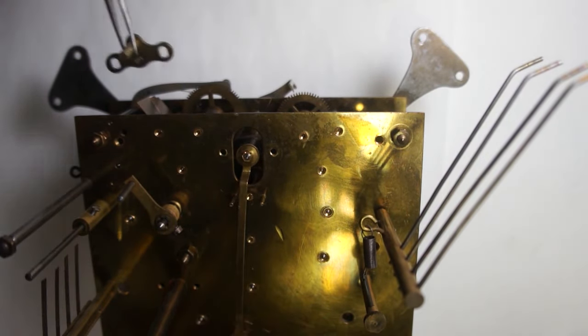So what I'm finding on this door is somebody in the past has glued this piece of cardboard on here. I believe they glued it on as a strengthener, and they've gone in the corners here and they've put some sewing needles in here for nails, and they've also taken some needles and cut them off and put them in the corners of these miters. I assume they must have had a problem with the door being loose.